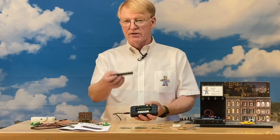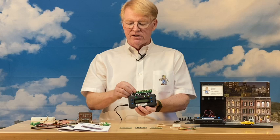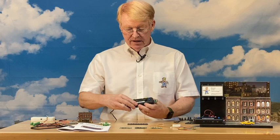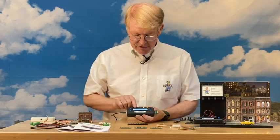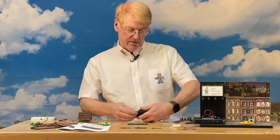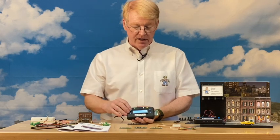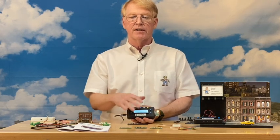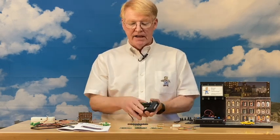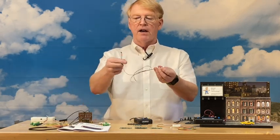You may want to consider the LED test board — it just has LEDs on it and plugs into the back and side of the main unit. That allows you to test the individual ports and configure them on the main unit. When you're done, turn the power off, unplug the test board, and plug in your individual LEDs.